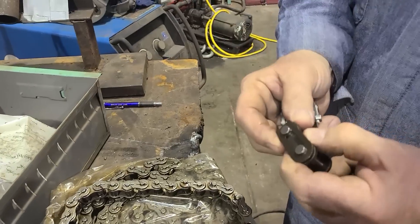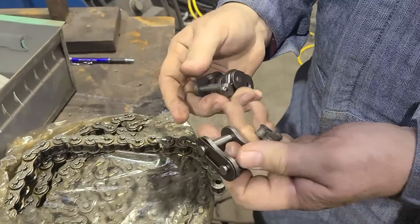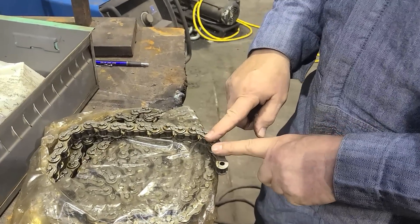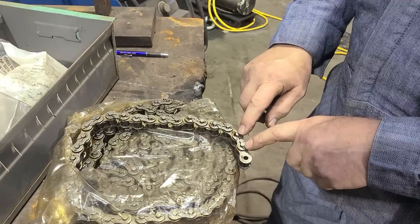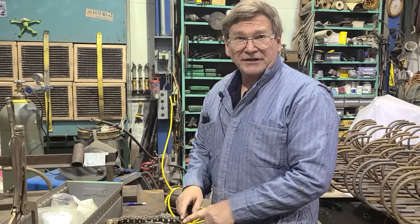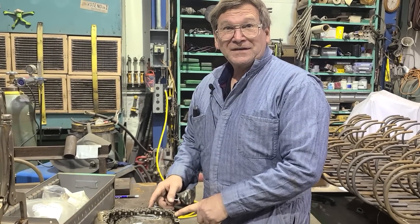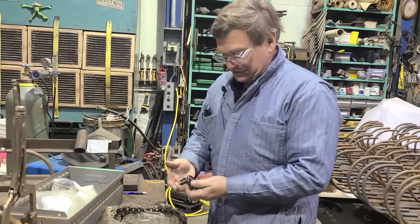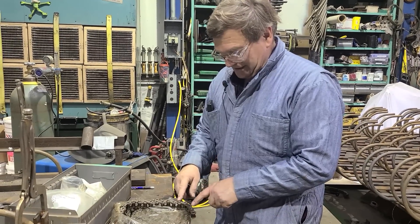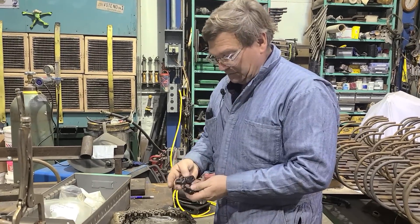These ones have a little spring clip commonly — you pry it a little bit, it comes loose, and then this backup piece goes in there. The ones with cotter pins, it's just a backup piece. When you get a fully cottered chain, while you can take it apart, these pins are a little tight — they're still pressed in there, pressed in tighter than it would be on a master link. Actual master links are made looser so that they slide together nice and easy, where these you can use as a master link but you're going to have to pound on it a little bit.